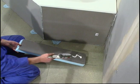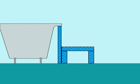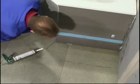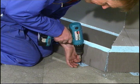Now we change to 50mm board for the load-bearing step. In a large bathroom it would be easy to create a 2-step access, but we'll stick with one and make it 200mm high and 300mm back to front. The back of the step is cut and bonded to the panels with silicone beads. Now the step front to give structural support and a great surface for tiling to.